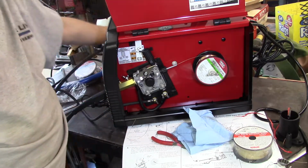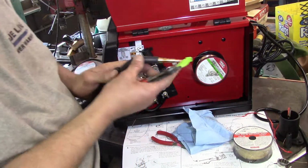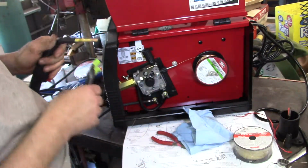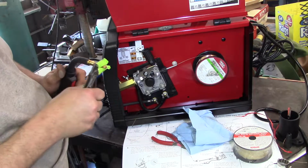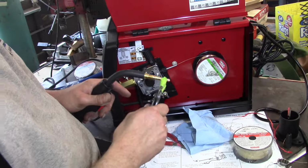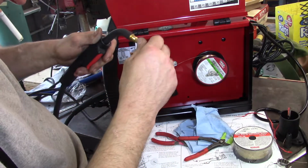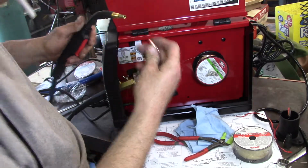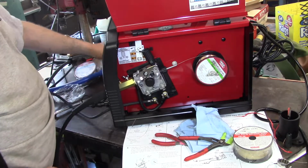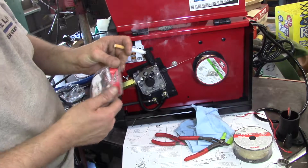I have to switch the tips out. This is set up with an 035 tip. If you try to run 025 wire through an 035 tip... notice too I put tape on my channel locks here, or my Knipex Cobra grips. I don't use channel locks anymore. Now we got a bag of goodies here that came with the gun.